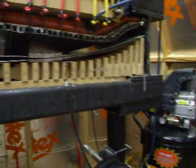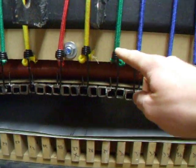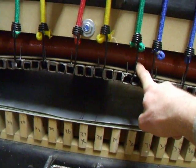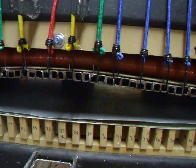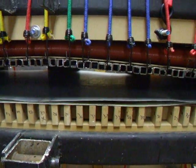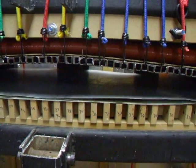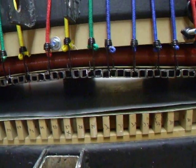So this entire setup is for sale. Basically what we've got going on here is a filler mold at top, with an air bladder just below. It's reinforced PVC tubing, good to 150 pounds. Because I'm using heat with it, I typically ramp it up to about 70 pounds, and I've never had a problem with it in the 30 or 40 times I've used it.